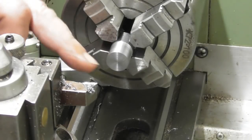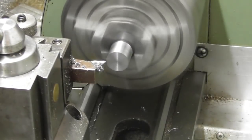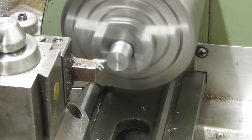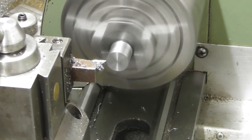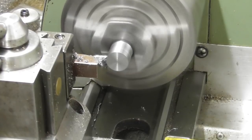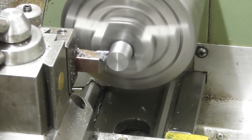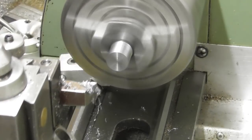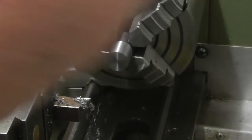I'm going to call that the finishing cut on the OD — the nominal five-eighths. We're going to make the eccentric strap to suit this. I may take another pass — I think I'm running way too slow for that material. That's just whispering off there, it's a better finish. Okay, so in one fell swoop that's the OD done and it's faced. I need to address the distance next, and while it's still central I'll put the undercut in, so I'm going to change to the parting tool.